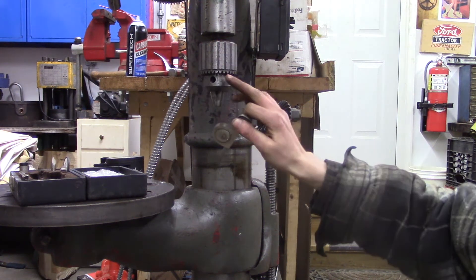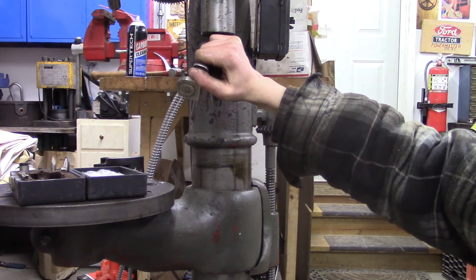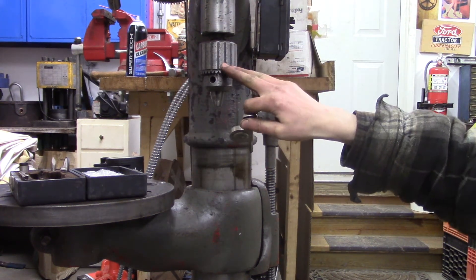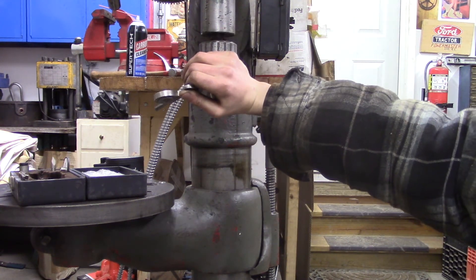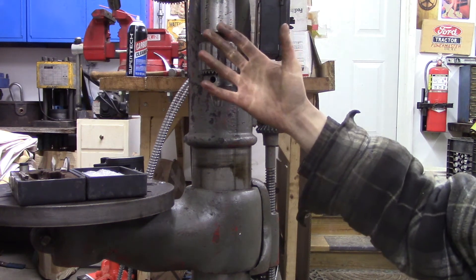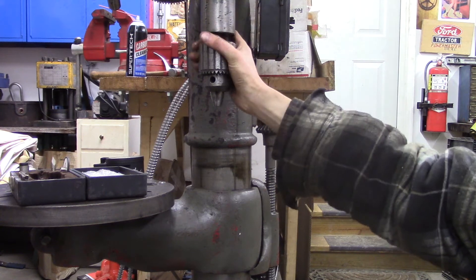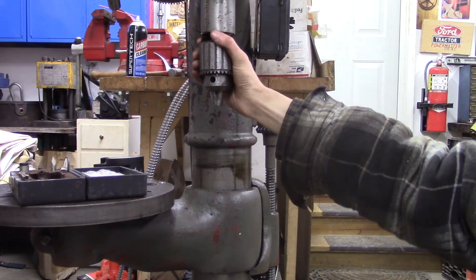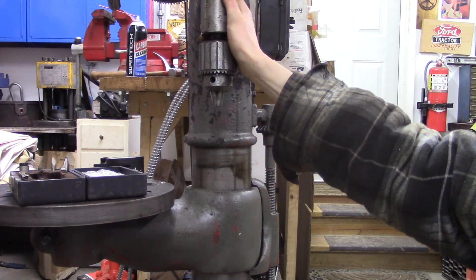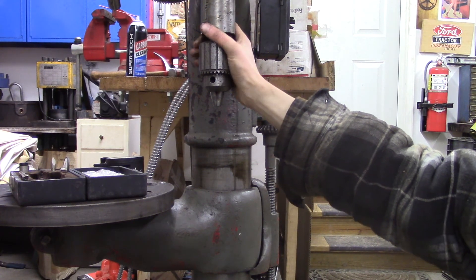Unless you have one of those infrared taches with the little reflective piece of tape - I imagine that would work. But anyway, that was a quick, fun little experiment. Now I have some bragging rights and some small talk available to me when I'm giving people a shop tour. 28 RPM is the lowest it goes and 480 RPM tops. So that is pretty versatile for an old machine like this - this machine is probably a hundred years old, it's got eight speeds, which is a fair number more than a lot of modern drill presses. And it's got power feed, which is super awesome. Anyway, thanks for watching, I hope you enjoyed this. Maybe you learned a little bit of something - I didn't know what a rev counter was until not too long ago. Make sure to leave a comment if you feel so inclined. Let me know what you think and stay tuned for more.